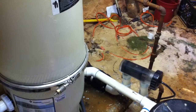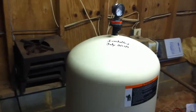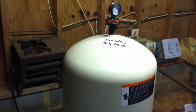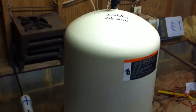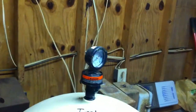What we've done here is, first in July 2010, we replaced it with a Pentair Quad DE100 — it's their largest quad filter that they make for swimming pools. It has 100 square feet in it. What that allows us to do is run at a very low PSI.